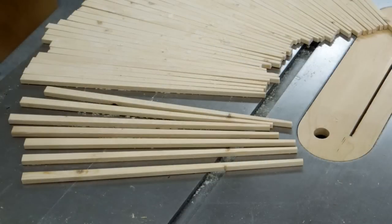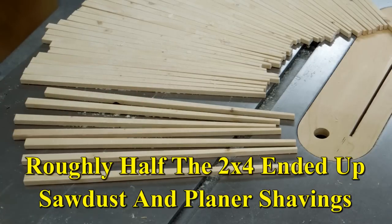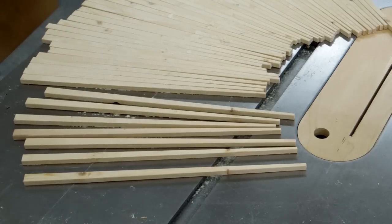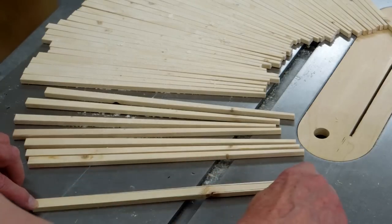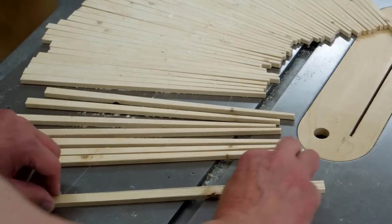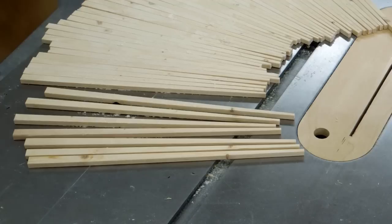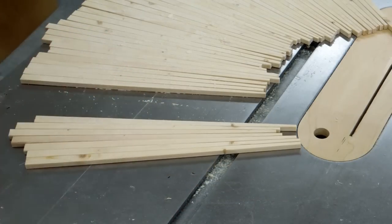All of my side slats are a half-inch wide, quarter-inch thick pieces of wood cut from a 2x4. It took four 13-inch long pieces of 2x4, flattened, squared, and sliced into pieces and planed to an even thickness to make 50-plus of these pieces. You're always going to have some that break. These are a half-inch wide. I marked a quarter-inch in the center and marked it for a taper. I rough cut those on the disc sander and then flattened them on a belt sander, just like I did in the video for building my first dust collector. These are not beveled — on this flat side you can see these all go together.